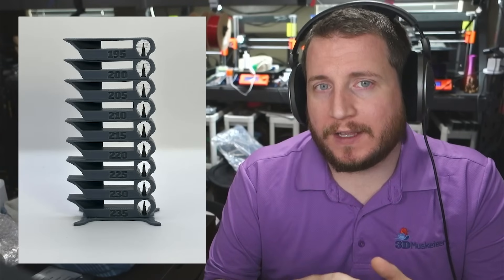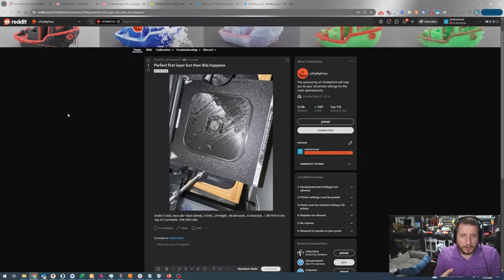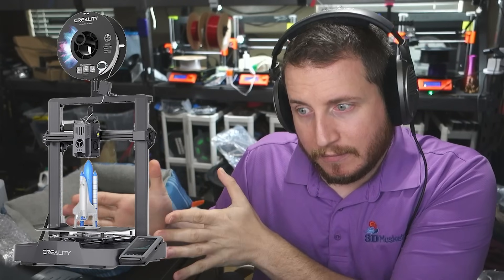This is where temp towers would be the perfect thing to do. If you start to see this, crank the temperature as a precaution. The only real downside of slowly turning up temperature is some stringing as the material goes beyond its ideal range. The SE is not Klipper-ized — unless they've added input shaping, that would be the KE version — so this printer runs relatively normal stock speeds. You'd need to turn temp up if running high speeds; if not, try 215 and maybe 220.